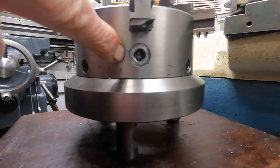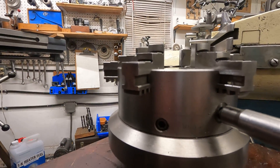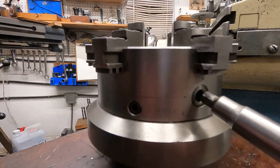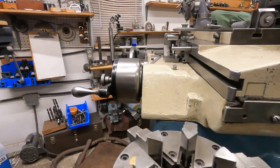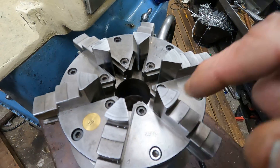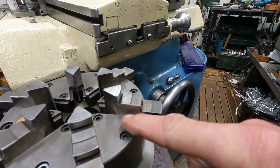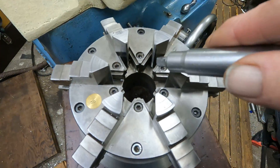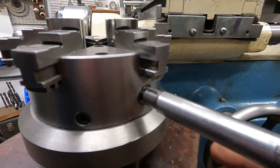Here's the pinion. On a buck chuck there's only one, so it's the master pinion by default, but newer buck chucks have three. That beveled pinion, when you tighten it, pushes the scroll forward, and it wears what we call a wear pad on the inside. So it pushes the scroll into the front part and wears it, then causes the scroll to cock — combined with the wear from the pivot. So you've got wear from the pivot and wear from the pinion pushing the scroll in.